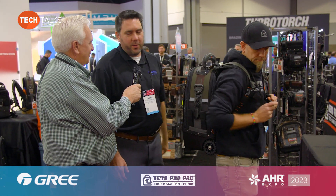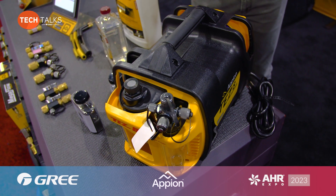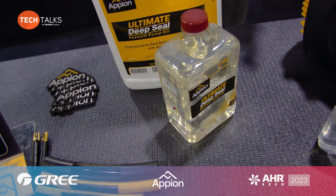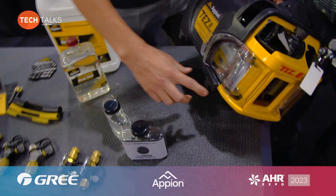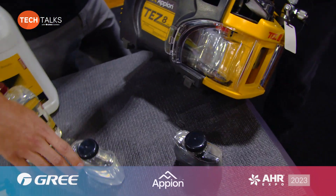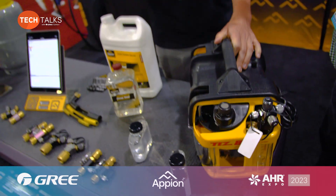What's important with evacuations is vacuum pump oil, and specifically keeping a low vapor pressure. Our vapor pressure on this oil is less than one micron, which determines how deep a vacuum you can maintain a seal. Keeping that vapor pressure low, you'll want to keep contaminants and moisture out of the oil. You can see right here where our cartridge ends up — it traps nasty oil from contaminants and moisture. Pop that one out, put a new fresh one in, and that keeps the clean oil maintaining that low vapor pressure.